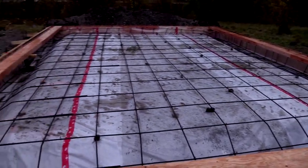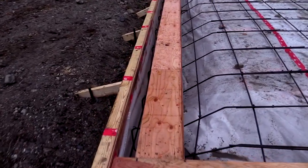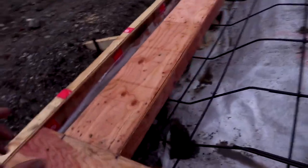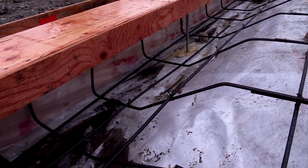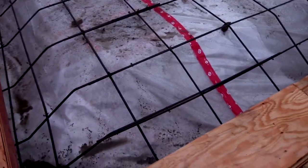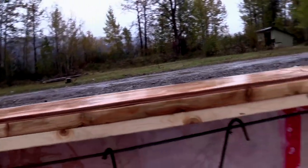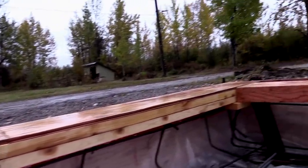This would be a good little episode for anybody thinking of building their own Quonset hut and installing these. It's a nine-and-a-half by three-inch deep groove that you have to set into your foundation that the side walls go into — you mount them in and then grout after. There's going to be concrete here and of course the whole slab in the middle. On the front we have one too, and this one's ten inch by three, which gives you a little lip for the back of your building to build your back wall on.